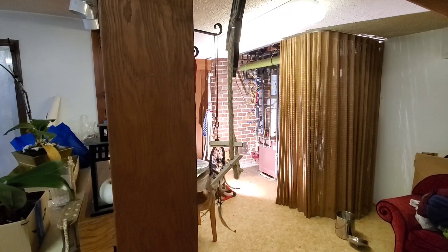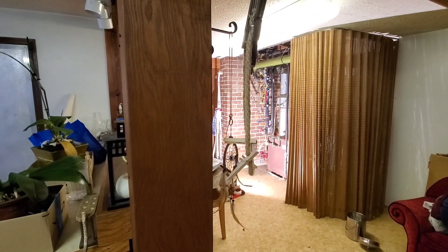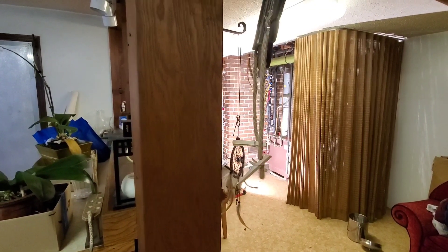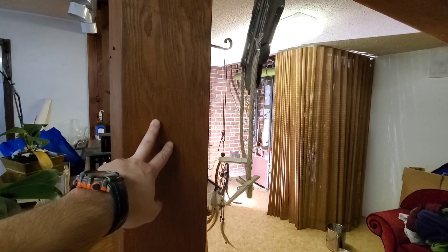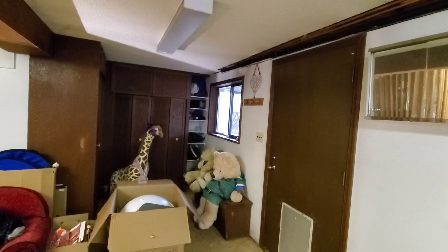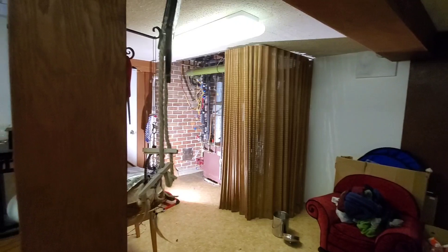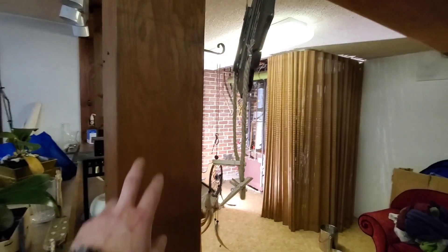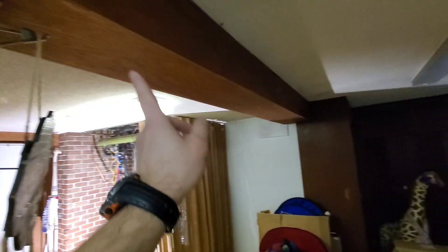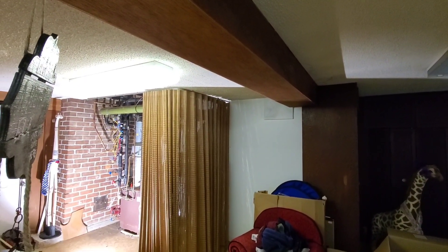This is the only room that has no heat because the thermostat location is unknown. The plan will be to install the thermostat here — center of the room is probably ideal for thermostat placement. If you have it near the light switch where the door opens, it's going to drop the temperature down, so you're going to have a cycling thermostat or a cycling zone. I'm going to put it here and follow the beam back to the boiler.